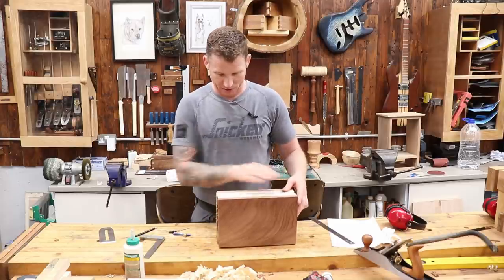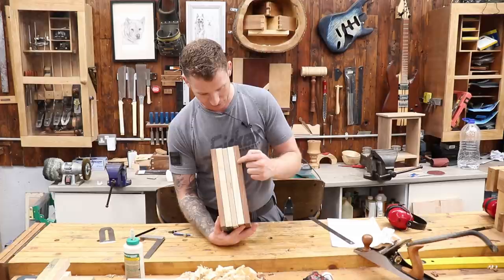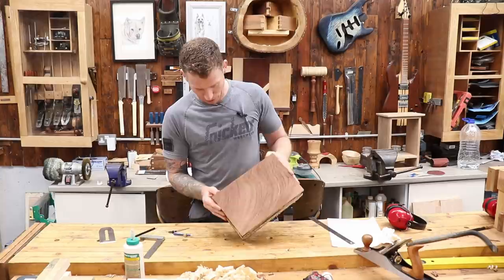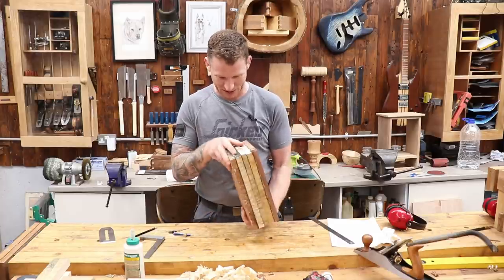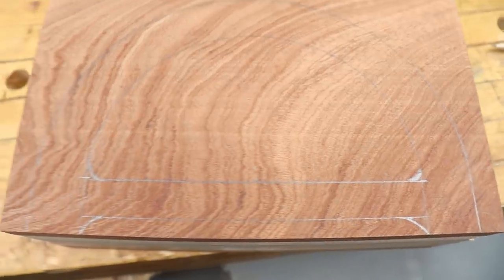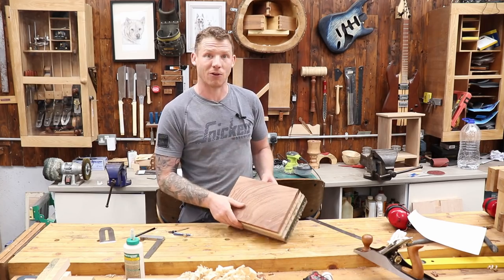We have the blank out of the clamps now — everything is glued up and seems to be holding. I took it to the planer thicknesser and squared off the base edge. You can see the nice design now with the black lines between the layers — it looks quite nice and really highlights those layers. The color core seems to be working and the glue seems to be holding up — looks like a good tight fixing. I've transferred the drawing onto the blank — I ran out of spray adhesive, so I just drew it on freehand. Now it's through the bandsaw to start cutting this out.